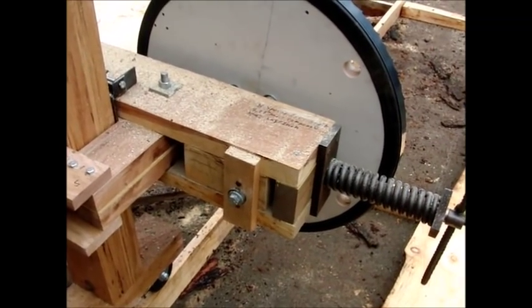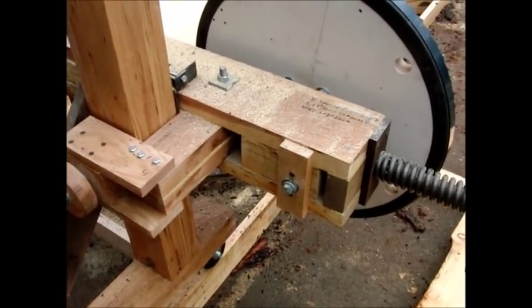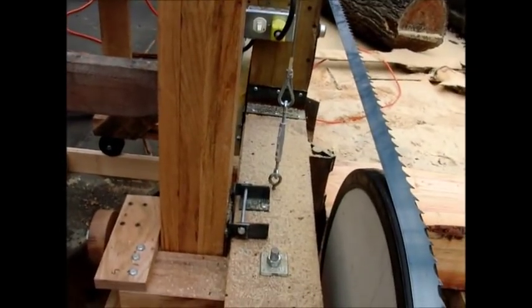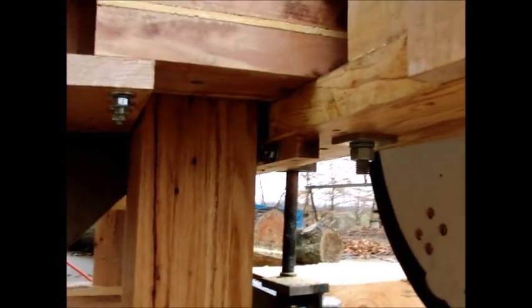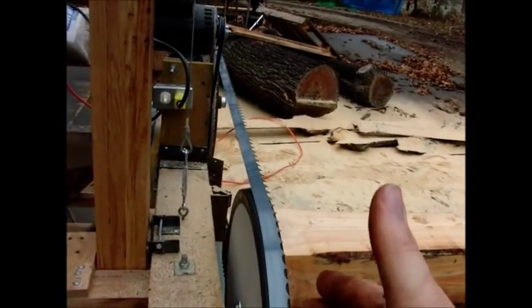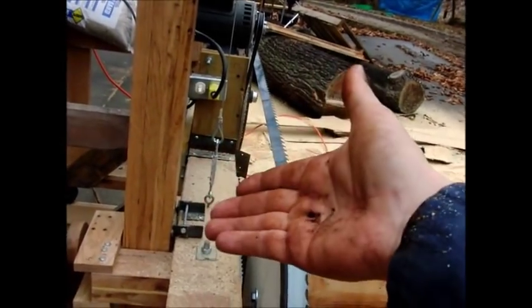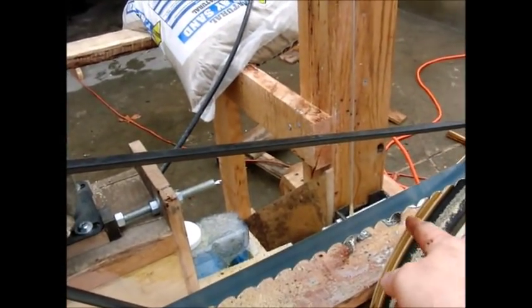The tracking adjustment on the take-up is that one bolt right here, and that has worked fine. I've also built in a little bit of adjustment to tilt the blade — that's the plate right here with a pivot point, and underneath there is an adjustment bolt that sets this. Basically I let the wheel kind of fall as it naturally would, sliding between a couple boards, so it's naturally tilted out just a tiny bit. Then I use that plate to bring it back to 90 degrees to the track. I have that same thing on both sides.